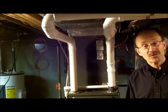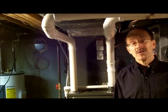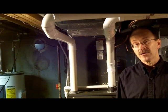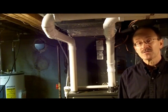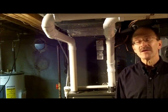Other things are life safety issues, as I mentioned — things like checking the batteries in your smoke detectors and carbon monoxide detectors. You can check your GFI receptacles. Those are the little devices designed to protect you and your family from electrical shock. They're placed near your sink in the kitchen, along the countertop, any place within six feet of your sink, or in the bathrooms, the garage, or any outlets outside. They're supposed to be under GFI protection and need to be tested, ideally, once a month.